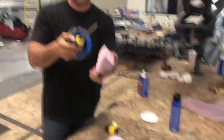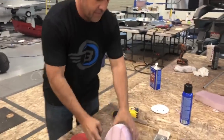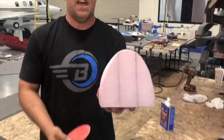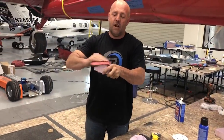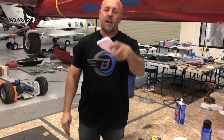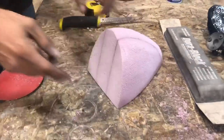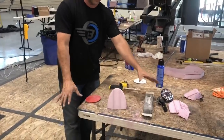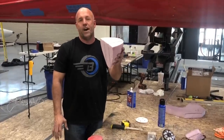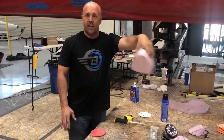I just freehand cut chunks out of it. Then this foam is so easy to sand — you literally can take off a half inch if you have a sharp edge, just like that. If you want to make a mold in seconds, there is a 10-minute mold. Set this down, drape six layers over it — I will have a mold done in 30 minutes or less, start to finish, when you use something this simple.